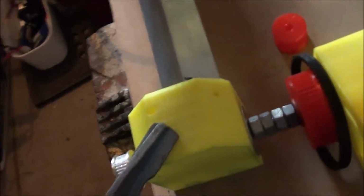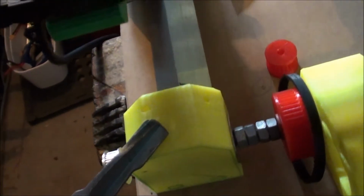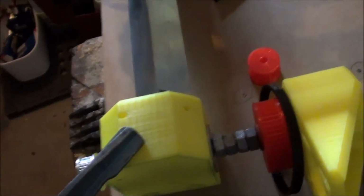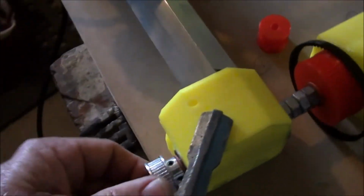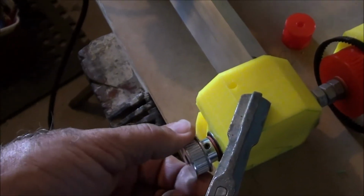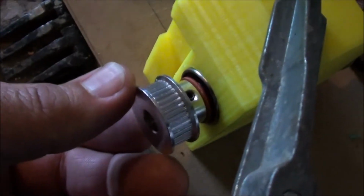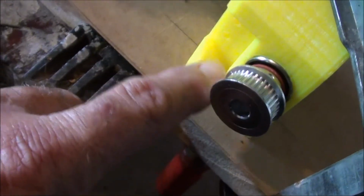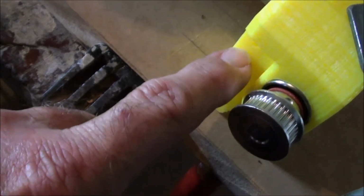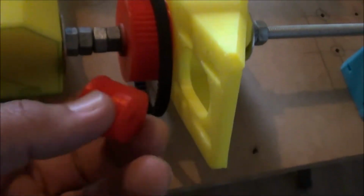The drive mechanism to drive the spindle carriage backwards and forwards is quite simple but effective. Now what I've done for the demonstration here is I've just put the sprocket on. You can see I've got my fibre washer in there, and again there's provisions for a limit switch in here, and I've just put this together. There's a sprocket there and the belt. The other sprocket will sit up here, and of course another stepper motor.